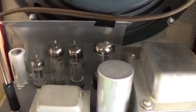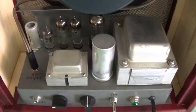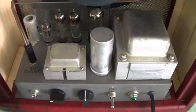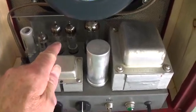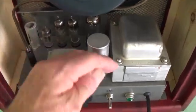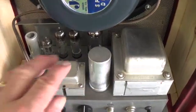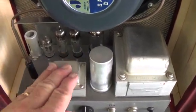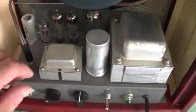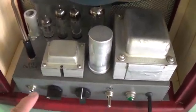I highly recommend that you do this. Now, there are three ways to place the chassis. You can do like I did and have the controls out the back with tubes at the front — and then I really recommend the heat shield. I've seen others where the lineup of tubes is along the back; you cut out an opening in the speaker baffle and have your controls accessible there. There's no way to have the tubes and controls on the same side of the chassis, simply because there's no room to put them in and wire them.